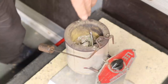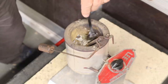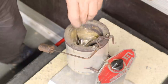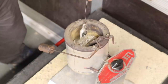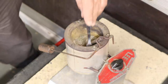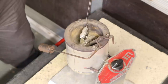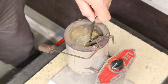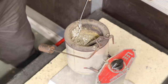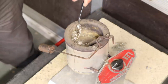That's just going through the process now, going full liquid, then we'll start cleaning it and you'll see the kind of stuff we get out. This is what is finely coated on the outside of that lead - it's surprising how much you get. My spoon's just doubled in weight, I left it in there too long. Look how dry that is - like just dry dirt that gets skimmed off the top.